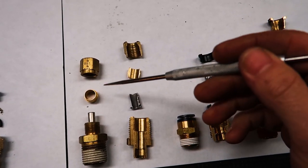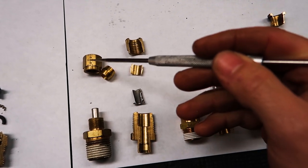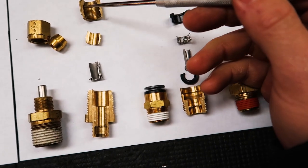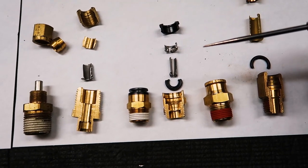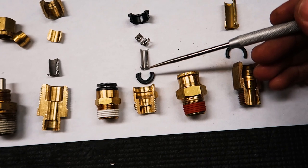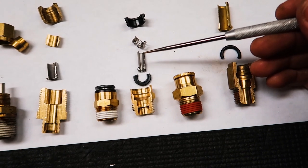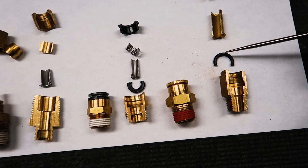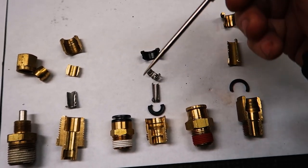On the compression type, the fitting will be permanently deformed around the tube and seat against the internal surfaces. On the DOT push-connect type, the tubing is retained by a clip against the o-ring, but they add an internal tube support on all of them — even the compression style. What that does is keep the tubing square and sealed against the o-ring, whether it's an x-ring or an o-ring, and it'll keep it airtight even if you side-load the hose or it isn't going in perfectly straight.